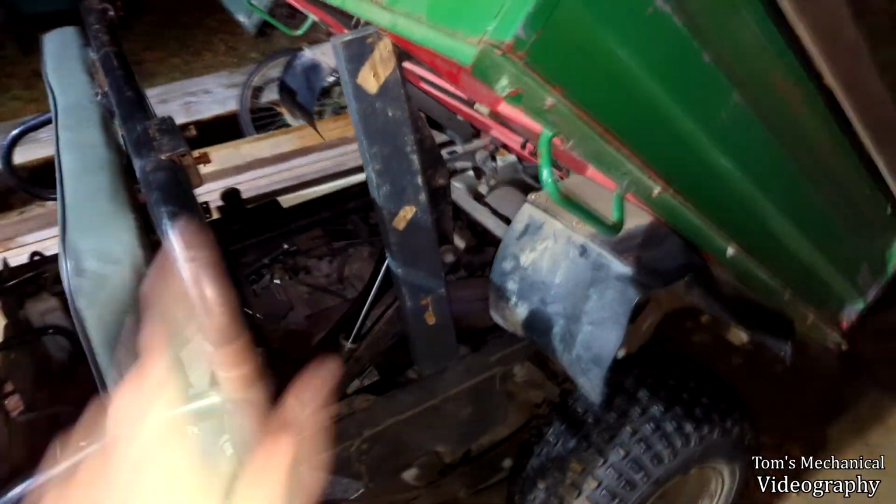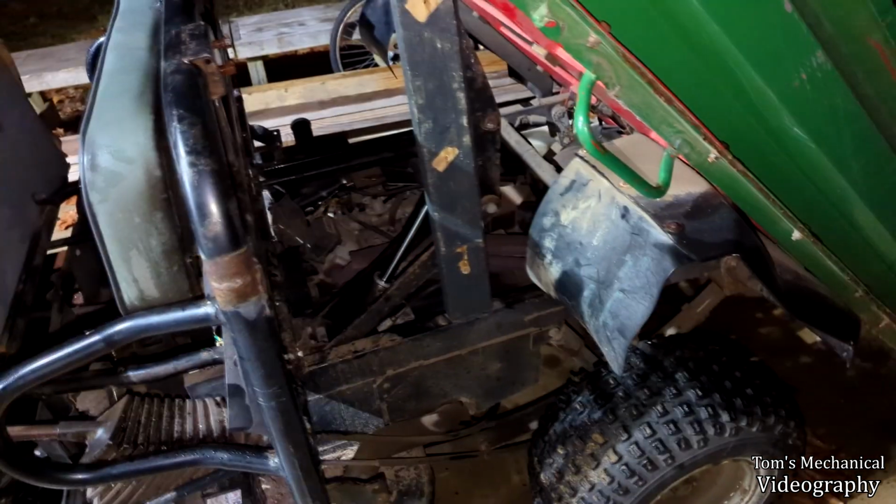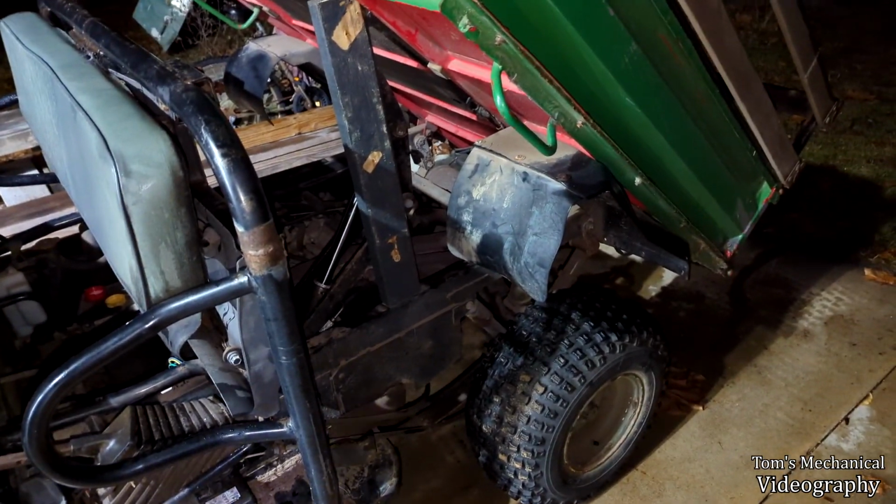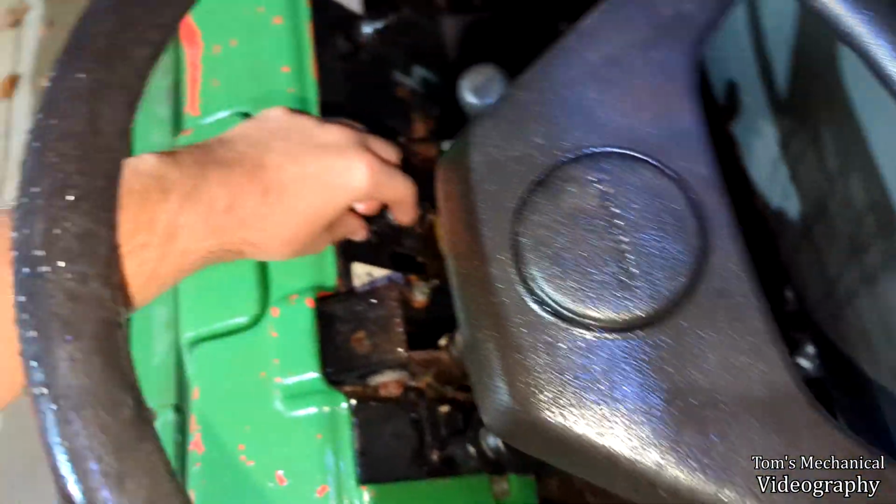And as soon as it feels like it's doing something funny, we're just going to start cycling the piston, and we're going to do that 3 or 4 times, probably 6 or 7, just because of OCD. It should bleed all the air out. We'll keep the reservoir topped off, and hopefully that'll be the end of it. We'll just see what happens.